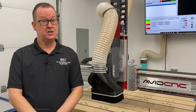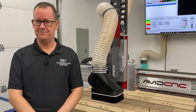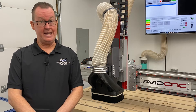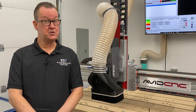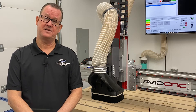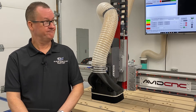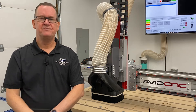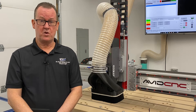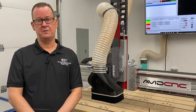In addition to the build, I wanted to produce this video for those of you scouring YouTube for more information. In order to assemble this beast and get it in the shop, I had to get a new shop — my garage just wasn't big enough for both machines. The Avid machine I chose is a 48 inch by 48 inch pro model with NEMA 34 stepper motors and an 8.7 horsepower spindle.